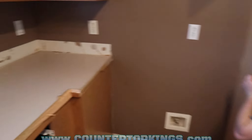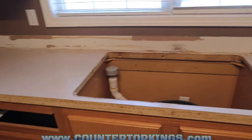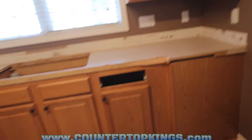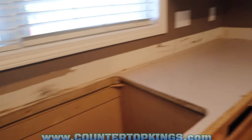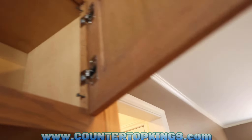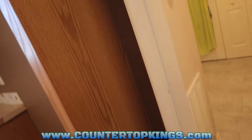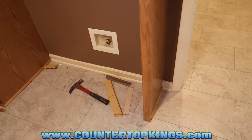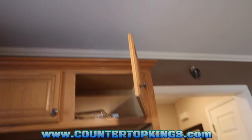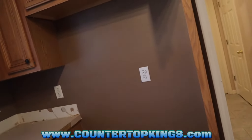Like I said guys, we've got this big piece here in one piece. I tried to make the customer tops in one piece because we try to get the best quality that we can. But in order to get this in here in one piece, I think we're going to need to remove this little side piece here of the cabinet. I've taken a couple screws out here, which opens it up there. And then this piece right here just popped right out. So right now we're going to cut the bead of caulk and then we'll pull out this little piece of trim here. And hopefully it should just slide right out. And then once we get the top in and get everything finished, we can just slide it back in.